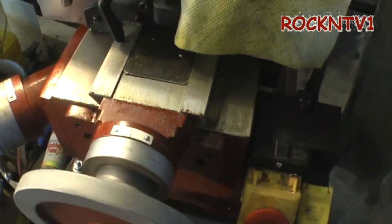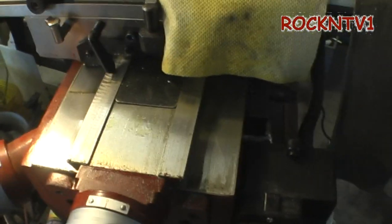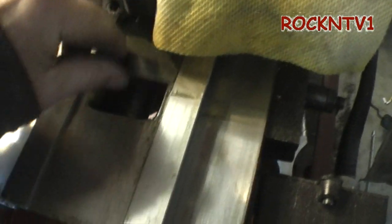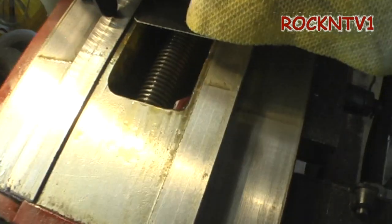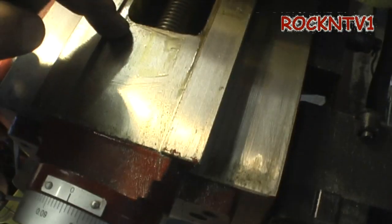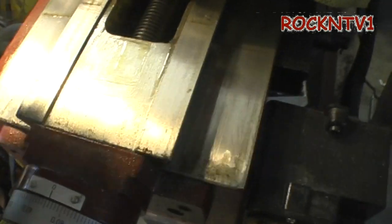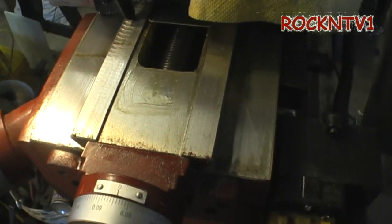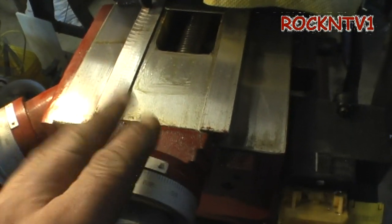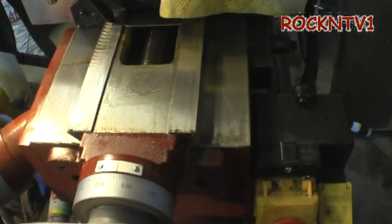About the Y-travel — the spec sheet says it's somewhere in the neighborhood of six inches or a little more. If you look down in here you'll see the lead screw is actually dragging that cover with it. There is about an inch and a half or two inches of travel right here that can be had by hogging this section out. Whether that is the case in all of these machines I'm not certain, but on this Harbor Freight 40939 it is definitely there — available to get yourself more travel towards the operator.